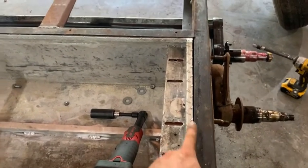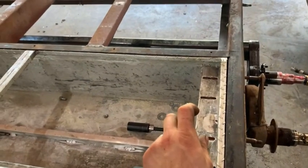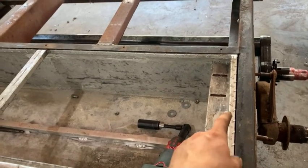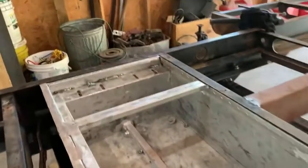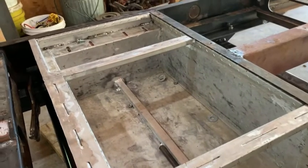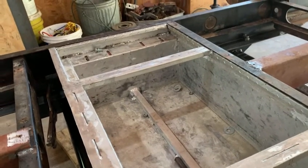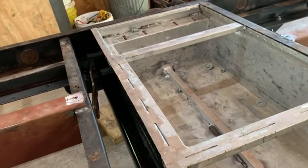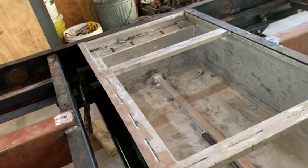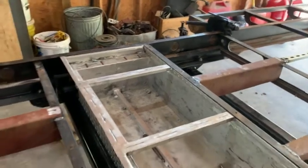So what I did is when I cut it, I just took the top lip extra piece I cut off and modified that and then dropped it down and welded it back to it. You can kind of see some of my ugly looking spool gun welds. I am not the greatest with it, but more so the problem is it's not designed to weld this thin a material, and it kept burning through, having a lot of trouble that way. But anyway, it came together all right.